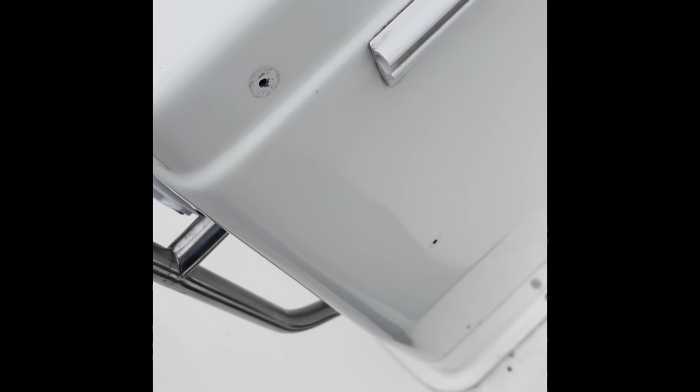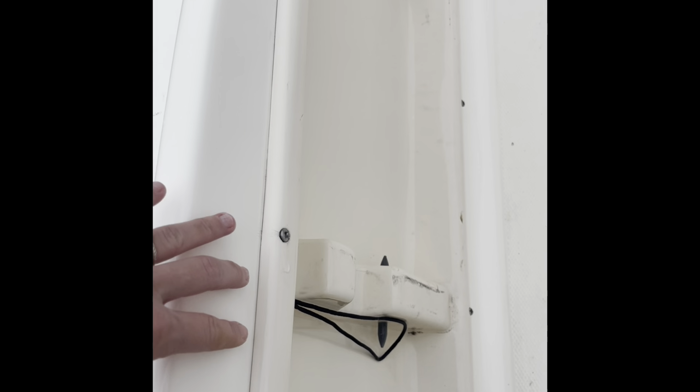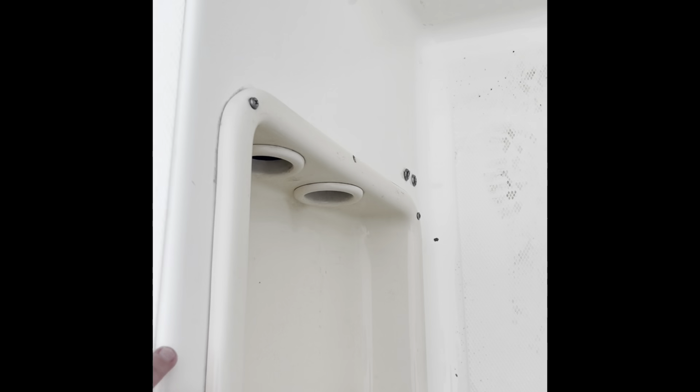I mean, you can see how much better it is. Maybe you can in the video. It's so smooth. But you don't want to leave it like that. You want to jump in with higher grits when you're this rough. This one's 600. These screws came out. I got all the way up in there. All of the edge in the floor. Up here where the buffer can't get.